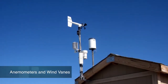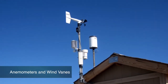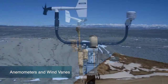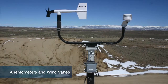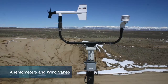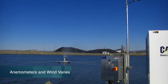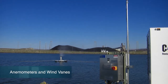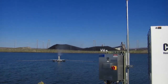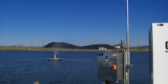SMI's complete anemometers and wind vanes provide weather updates, allowing the unit to be turned on and off based on defined drift limits and wind conditions. The weather data — ambient temperature, relative humidity, wind speed, and direction — defines varying flow curves from different water makeup and fluid temperatures. These proprietary flow curves combined with SMI's Smart H2O software and controls optimize the process for enhanced evaporation.